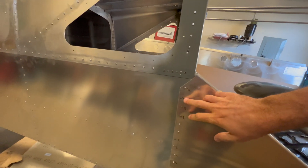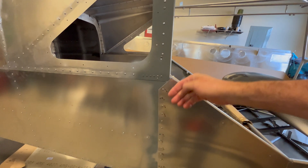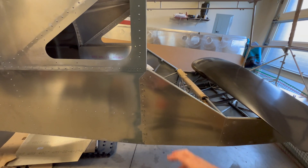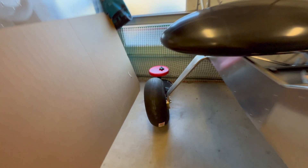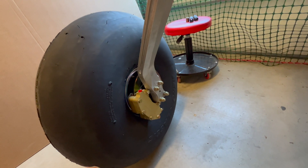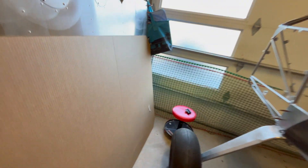The other two things — mistakes, I guess — but I'm not as shockingly embarrassed. I did replace three steel rivets here because there was a spacer that I fabricated for inside, extra spacers just to make the fuselage tail cone fit right. It needed a longer depth of a rivet. And then the third thing I want to fess up to: I realized I have to go back and torque the axle nuts down. To do so you need to stick a wrench in there, so I need to take off this entire wheel, times two. We're going to roll the tape. Here is episode 11 — landing gear and fixing mistakes.